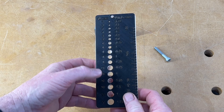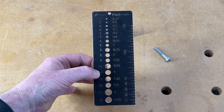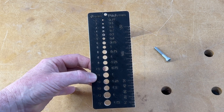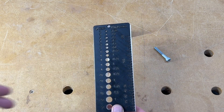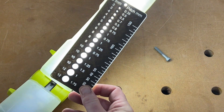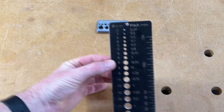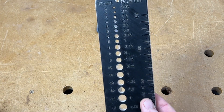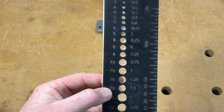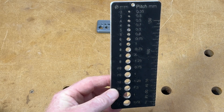There were a couple of downsides. First, I made it out of solid plastic with raised lettering, but raised lettering made the whole unit too big, so I shrank it down using engraved lettering instead. The downside with just one colour of plastic was it was a little bit difficult to read the different scales. So I've actually printed it in clear plastic on the back with a thin layer of black plastic on the front — that allows light to shine right through the gauge and makes it extremely easy to read. One downside is you get a bit of stringing in there when you print these, which really needs to be cleaned out before you can use it accurately. The easiest way is with a tap, which kind of defeats the purpose, but it's doable and you end up with a nice little gauge.